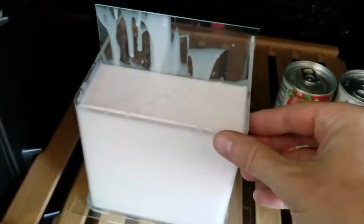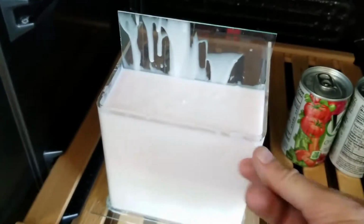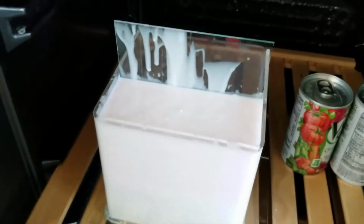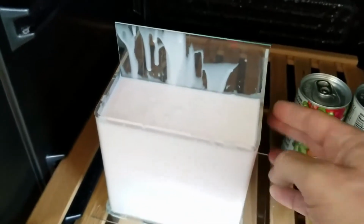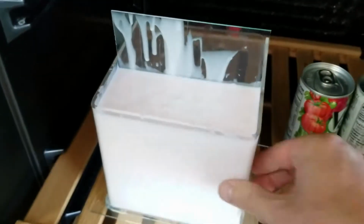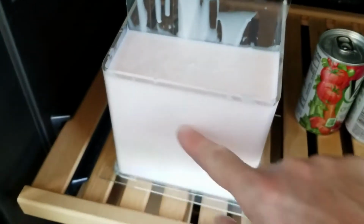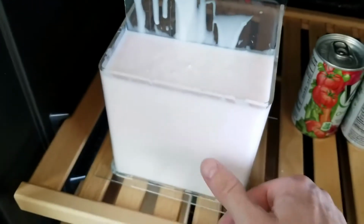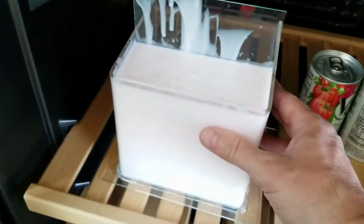Alright, so I filled up the mold most of the way, and then there's like a half inch close to it around on all sides, and then I ended up chopping up some of the used pieces of silicone a little bit finer, and then kind of sprinkling them in, and pushing them down, and I was able to fill up this cavity with some bigger chunks of the used silicone, so I didn't have to use quite as much silicone to cast this.